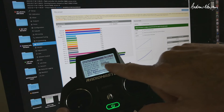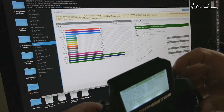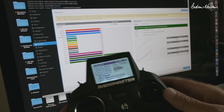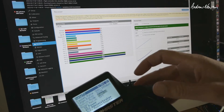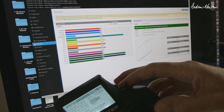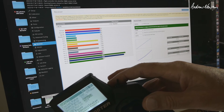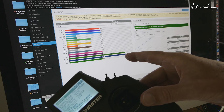I just had a bright idea — while connected to the flight control board I can demonstrate the difference between switch mode Hybrid and Wide. I've set up channels 5 to 12 on either the S1 or S2 slider so we can see the smooth operation of the slider and what it does to the output. You have to power down the receiver to change between Hybrid and Wide. In Hybrid switch mode: channel 5 is just on/off with the slider going from one extent to the other. Channels 7, 9, and 11 are six-position switches.